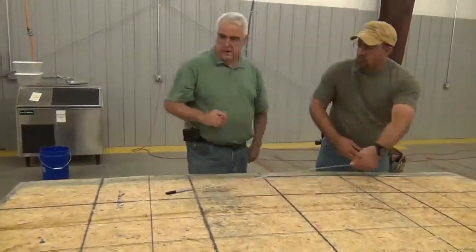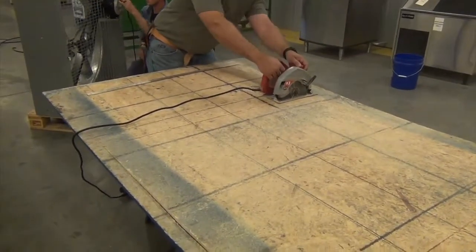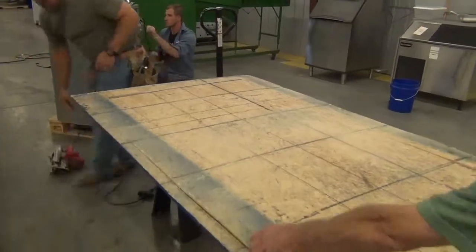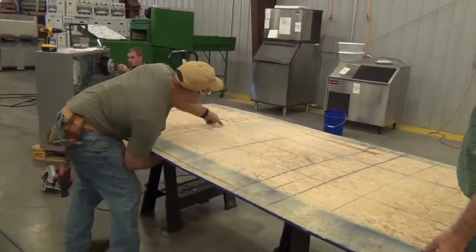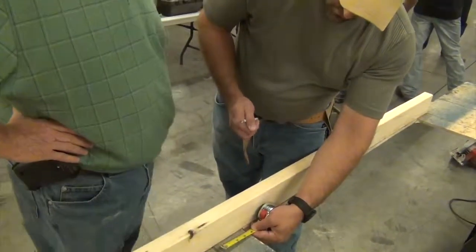Okay, once you have all your tools and materials, it's time to take measurements to cut out the rough opening of the fan in the OSB. We want our fan on a 6-inch pallet, so the rough opening in the OSB will be 6 inches from the bottom. We now want to screw on the frame for the rough opening with 2x4s. We will start with the top of the frame, leave an extra 1.5 inches on both sides of the rough opening for the 2 remaining 2x4 pieces to lay.